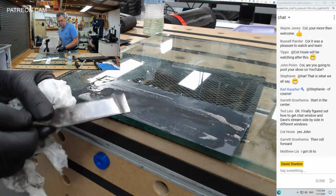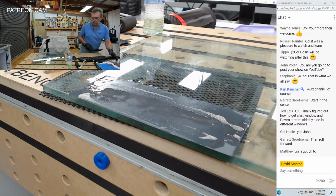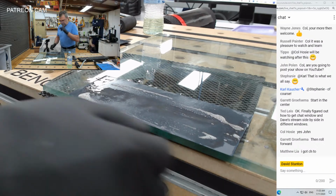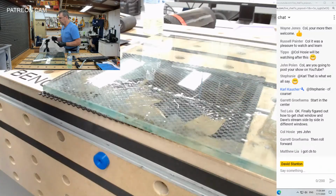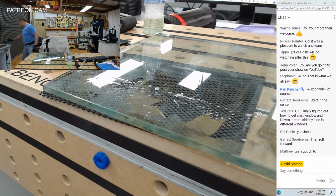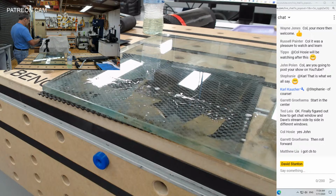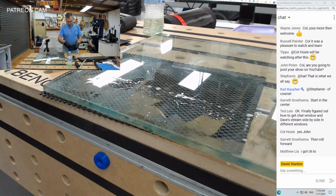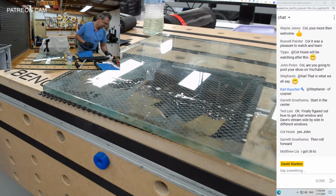That's starting to shine up down here. This chisel's going to need a whole lot more work. I'm going to stop going on that one. We'll just go with the other one. So that was 1,000. I'll put that to the side because I can still use that and clean it when it dries out. Next I'm going to go to 1,500, and then we'll finish off with 2,000. Then we'll jump on the Sorby, and I'm going to knock over 6 chisels in record time. You'll be amazed.